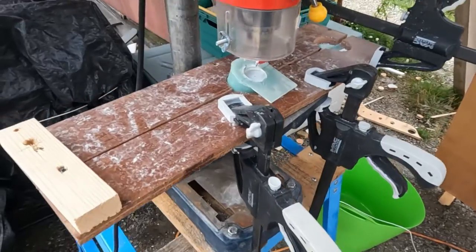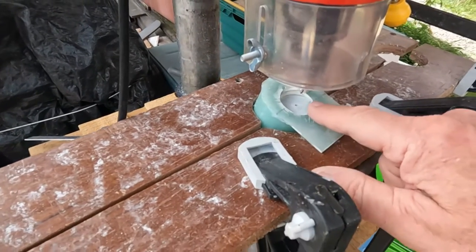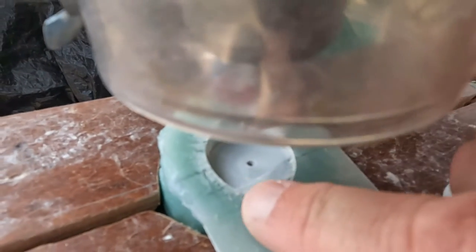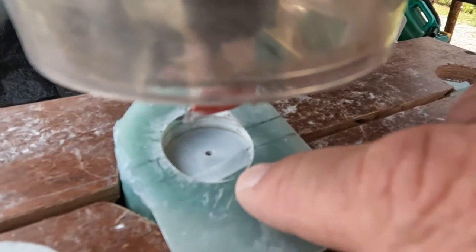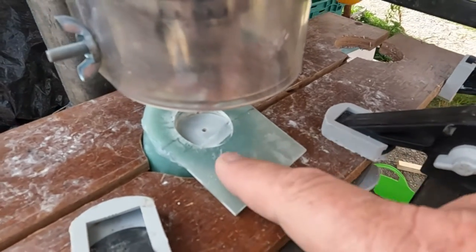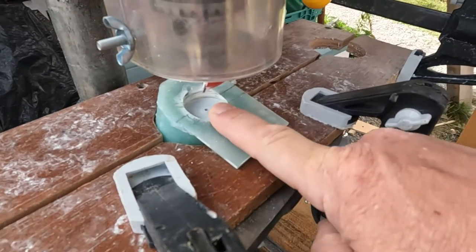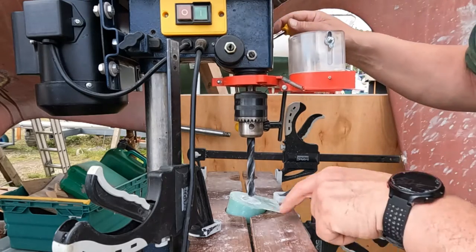Quick update — I'm working on my mast tangs. I've carefully marked the centre for the Forstner bit and drilled that out. You can just see the line where it's stopped cutting through the end plate — so I'm really pleased with that. It means there's quite a significant amount of the end plate that will be under the washer, which will obviously assist the glue in that staying on. I'm now going to use that centre point to drill with the new 12.7 millimetre drill bit.